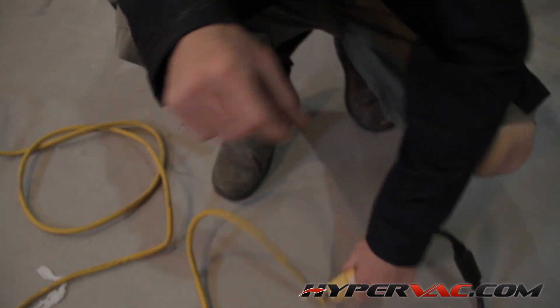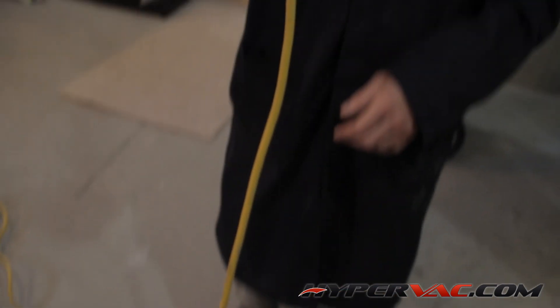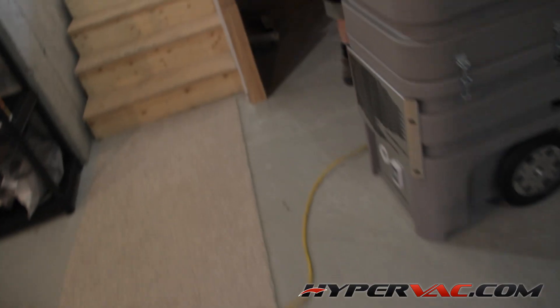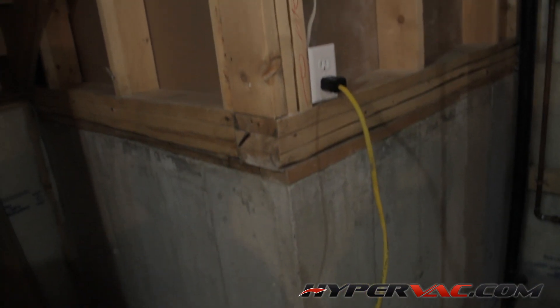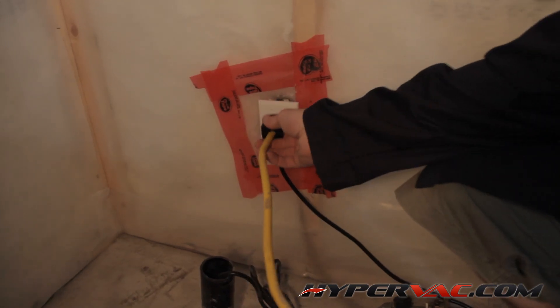In order to find the second phase in the house, keep in mind that your extension cord needs to be wired correctly as well. It may take a few tries, but this is simply a matter of trial and error as you plug in the second cord until the orange light on the Quick 220 turns on.